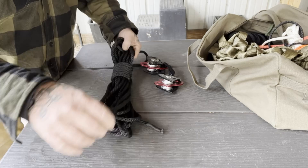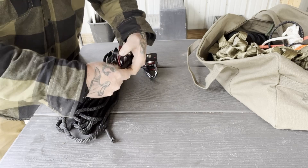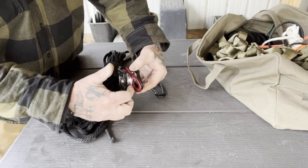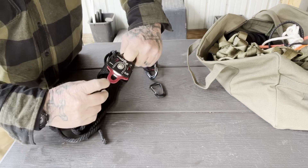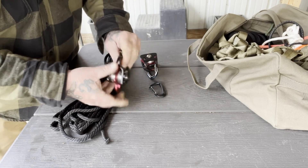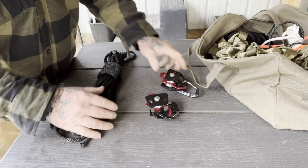So what we've got here is a piece of rope that's about 30 to 40 feet long. We've got a couple of carabiners here that have pulley blocks on them, and these are double sheaves — they have two pulleys, and you can basically open them up to put rope in and close them back up, then connect them together with one carabiner or soft shackle. You also have an area where you can hang another carabiner for your system. It's a very versatile system, and I carry two of those in my rope bag usually, plus one carabiner just like this.